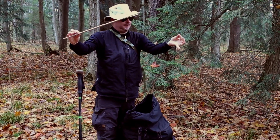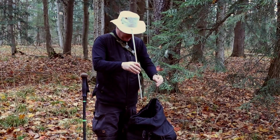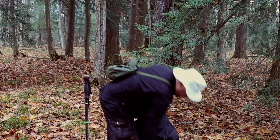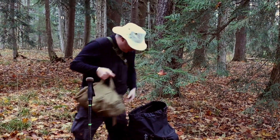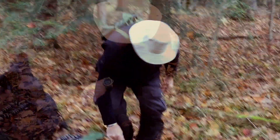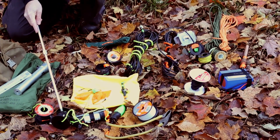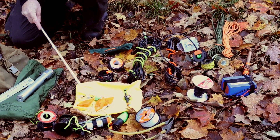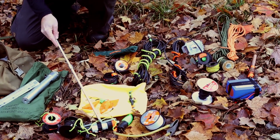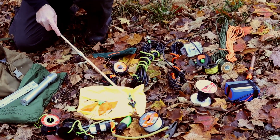There are other parts for the super antenna — this is the fastest antenna I can deploy, and later on I'll actually be able to walk with it already assembled. It's not the most efficient antenna, so we need more antennas. This is the antenna bag. We have the super antenna, and we have a 20-40-80 dipole with traps for instantaneous band switching, plus a 2-meter section on this dipole. This is a feed point that I can attach any piece of wire to make an antenna.